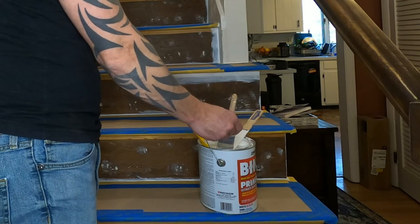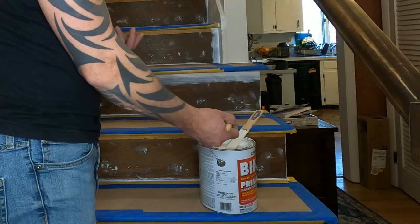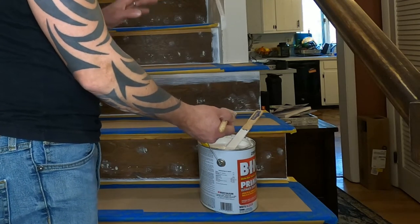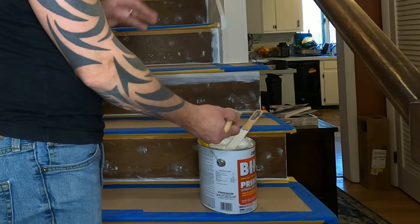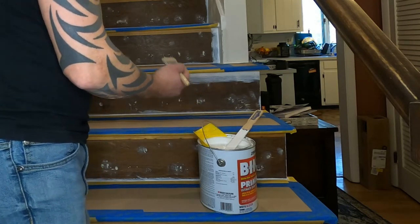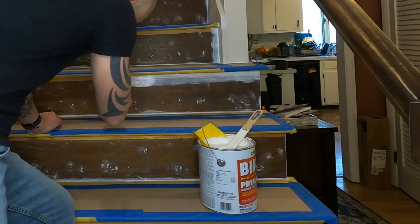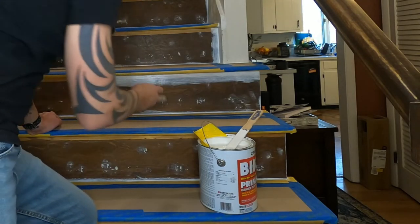I don't like the lamb's wool or the synthetic woven type rollers because it does leave a texture. That's okay on ceilings and walls and whatnot if that's what you're looking for. But I'm gonna use the foam. It works out really well, I've found in the past with painting some of the doors, like our slider doors